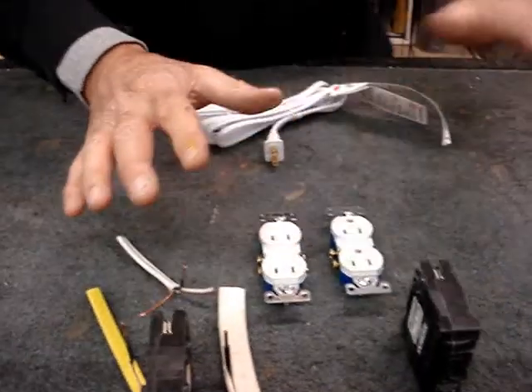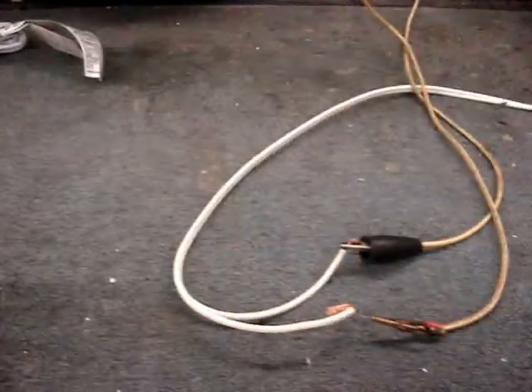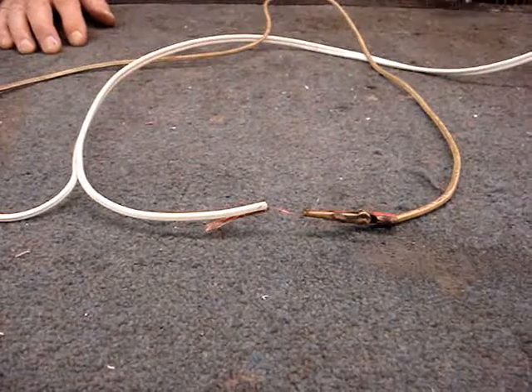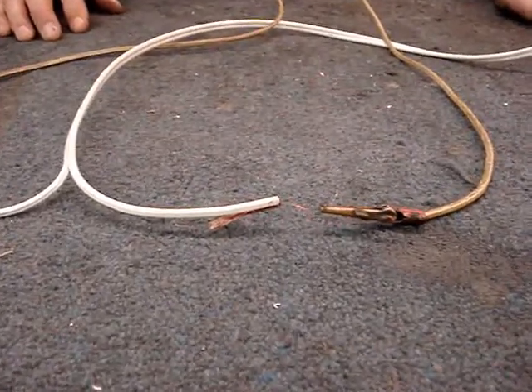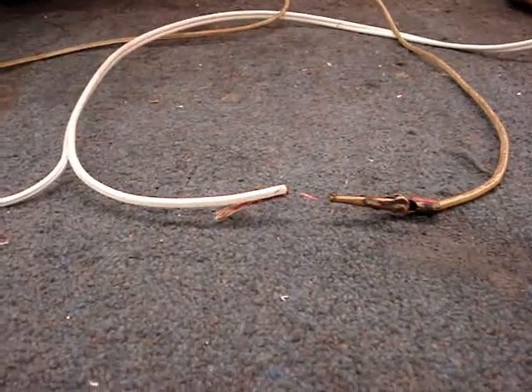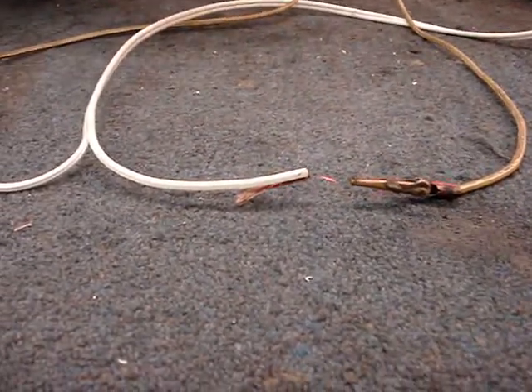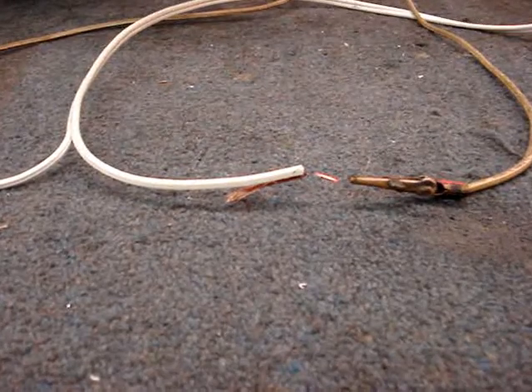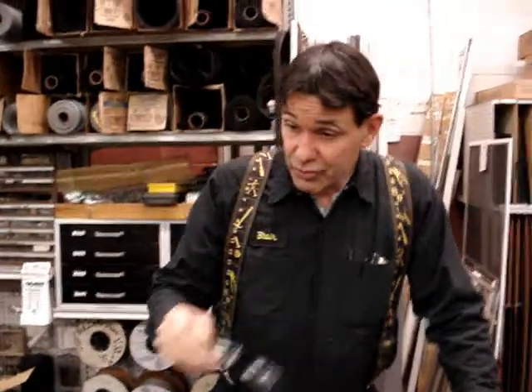To show you what happens when we overload a circuit — we put 1,000 watts of lights on this single wire. See the wire is slowly getting red as it's feeding those light bulbs. The problem with electricity is it will pass as much current as the draw demands until the wire gets red hot and melts and burns. So when you overload a circuit — by plugging in too many lights, putting in too big a fuse, not using any precautions — this wire could be somewhere in your house, could be attached on your roof. You never want to overload a circuit because we just showed you what happens. Thank you.